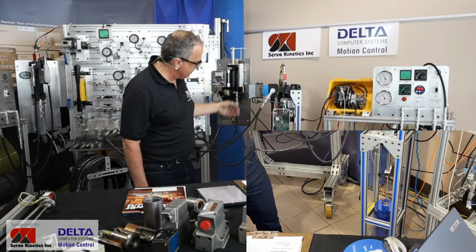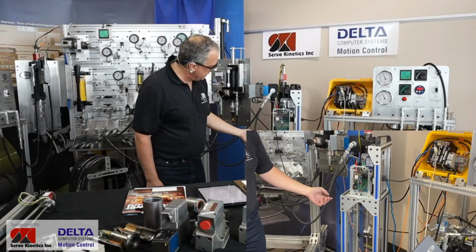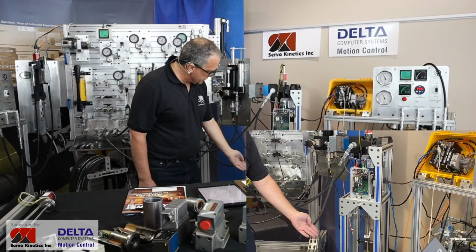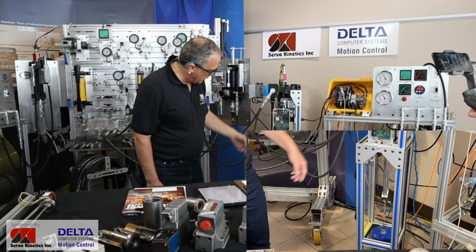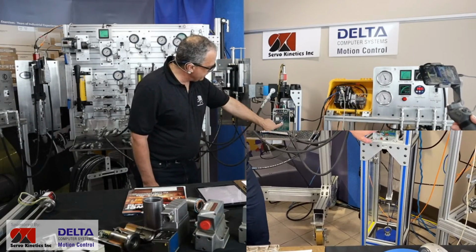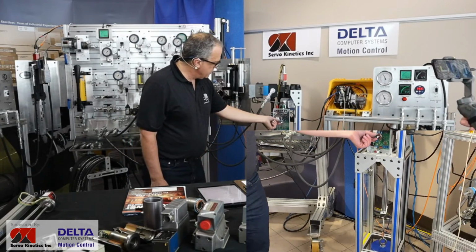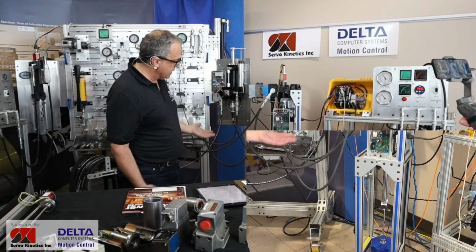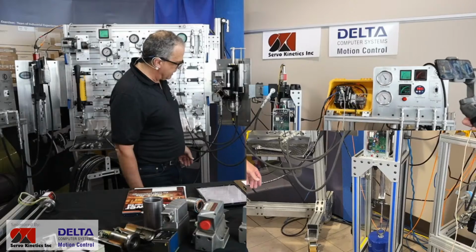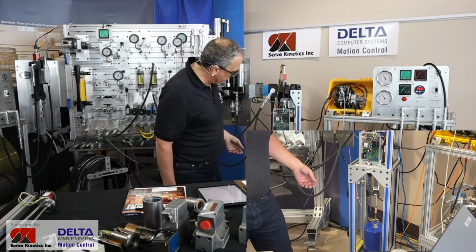That's on the other side of the stand. But this manual electronics is basically set up to allow us to command positions between the bottom of our 12-inch stroke when our potentiometer is pointed to 3 o'clock, and if I point it to 9 o'clock, that's the position called retracted, and that doesn't look very servo-like because it basically looks like I'm just opening up a valve and asking for full extend, full retract.